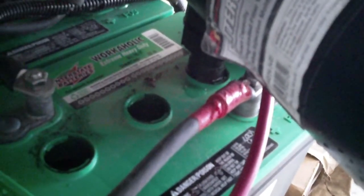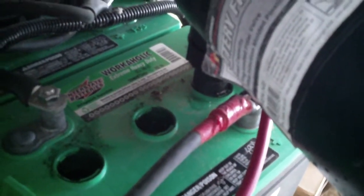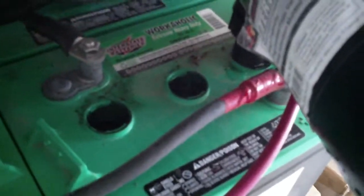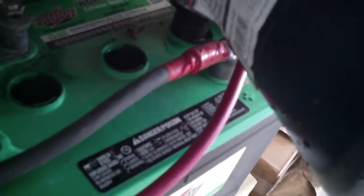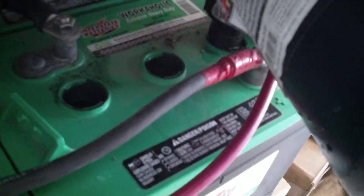Last time I did this, I went through three gallons of water across 22 batteries, so it does use them up. I do it two to three times a year. You just have to make sure you stay on it, because if you don't, you could fry your batteries — and that's a lot of money invested if you don't take care of them.